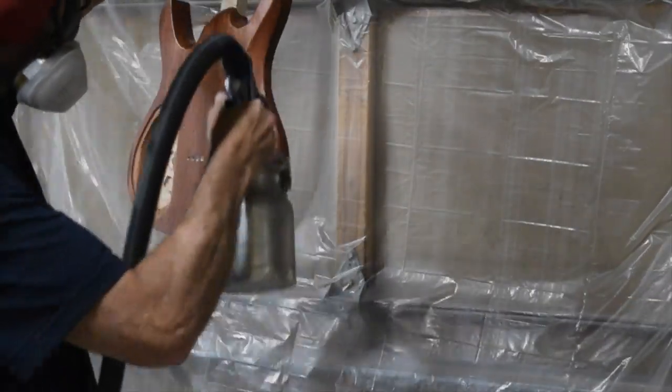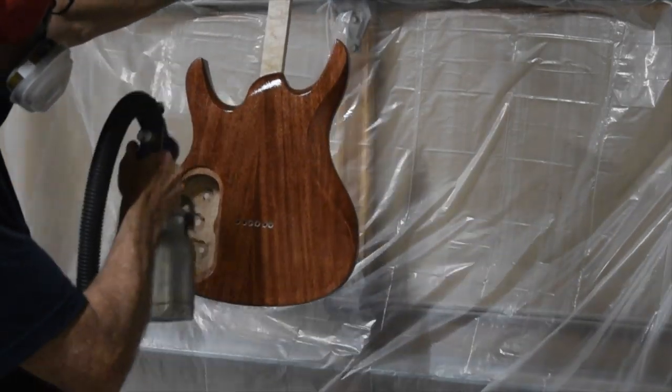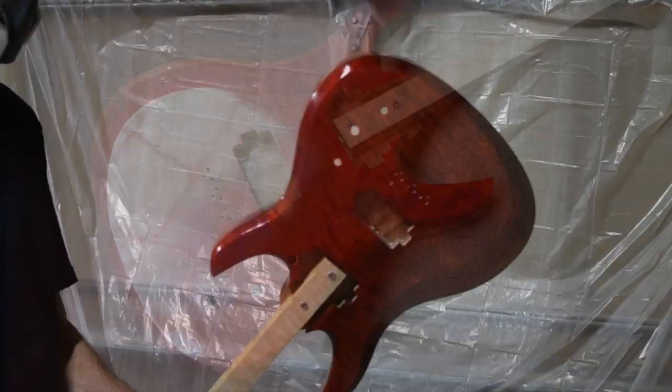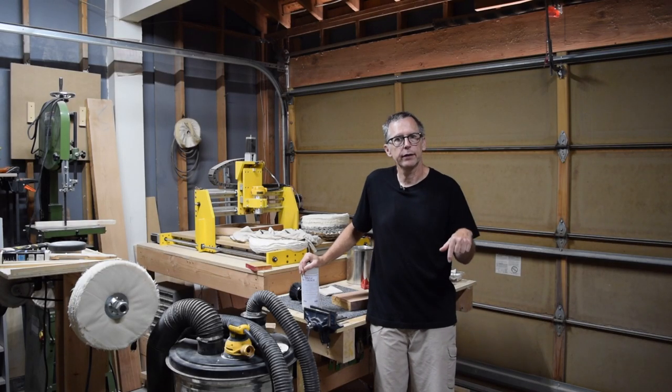Here's a better photo of the surface after spraying three to four coats of Crystallac Bright Tone with the retarder. You'll see it's still a little bit rough, but it's nowhere near as bad as it was before I added the retarder. I'm confident I can begin level sanding the surface with about P800 grit instead of having to back down to 600 or even 400 grit.